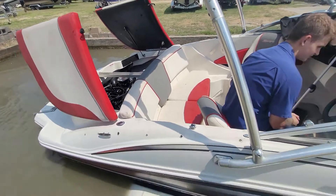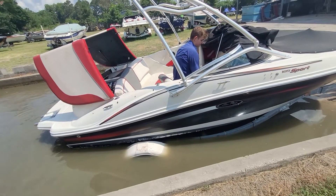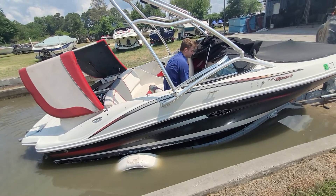In neutral it doesn't shake, but in driving gear it shakes just a little bit. It's in forward gear. Oil pressure in forward gear is 40 pounds. Temperature is good — 160 something. Probably has a 165 thermostat in it.